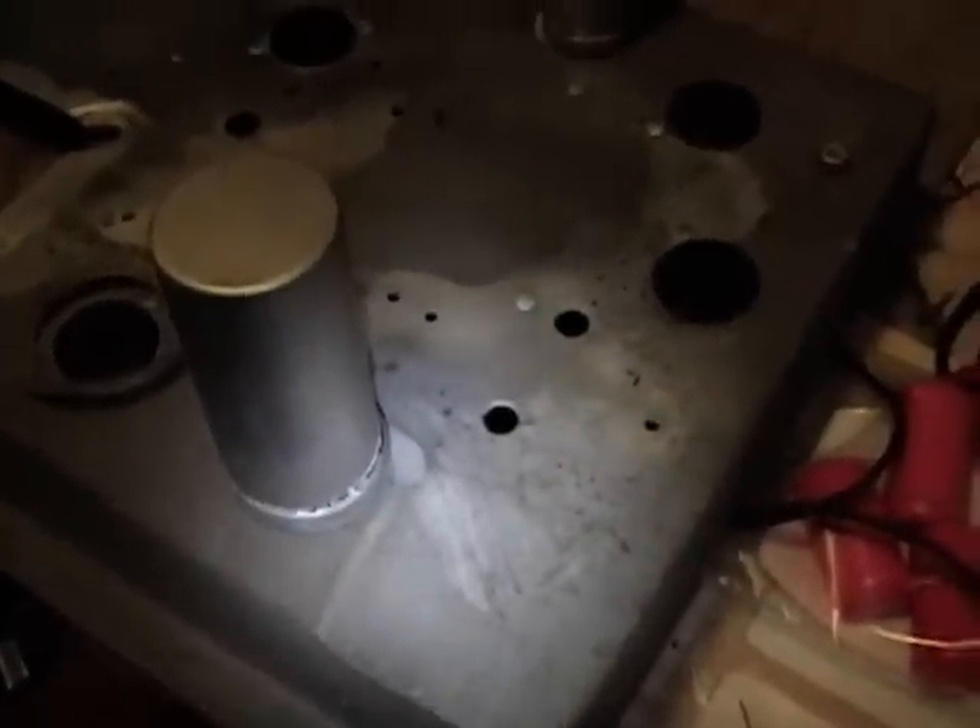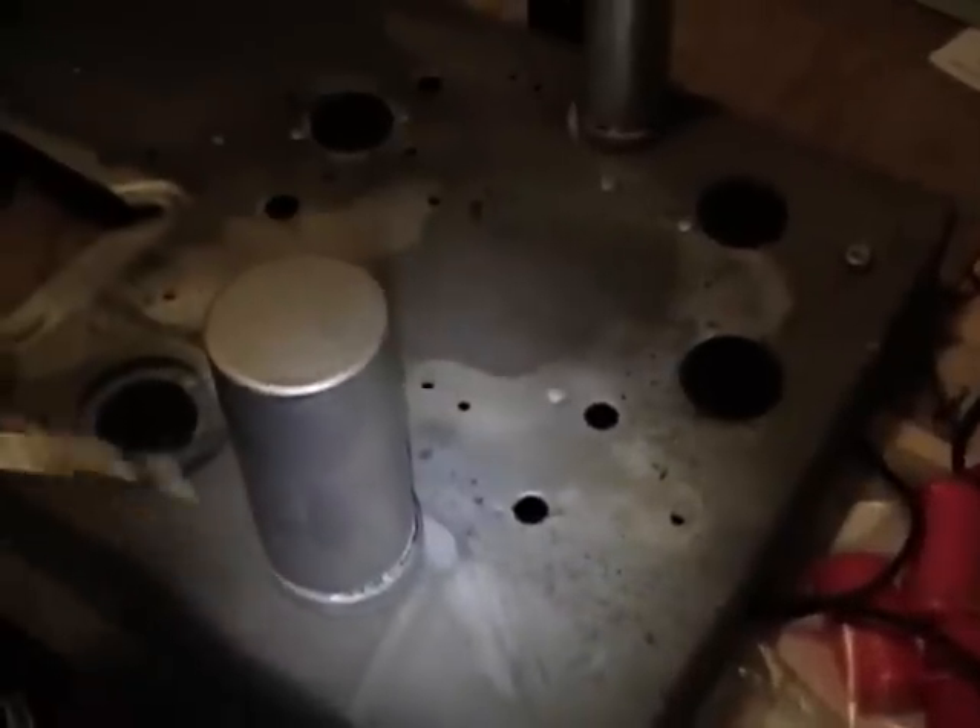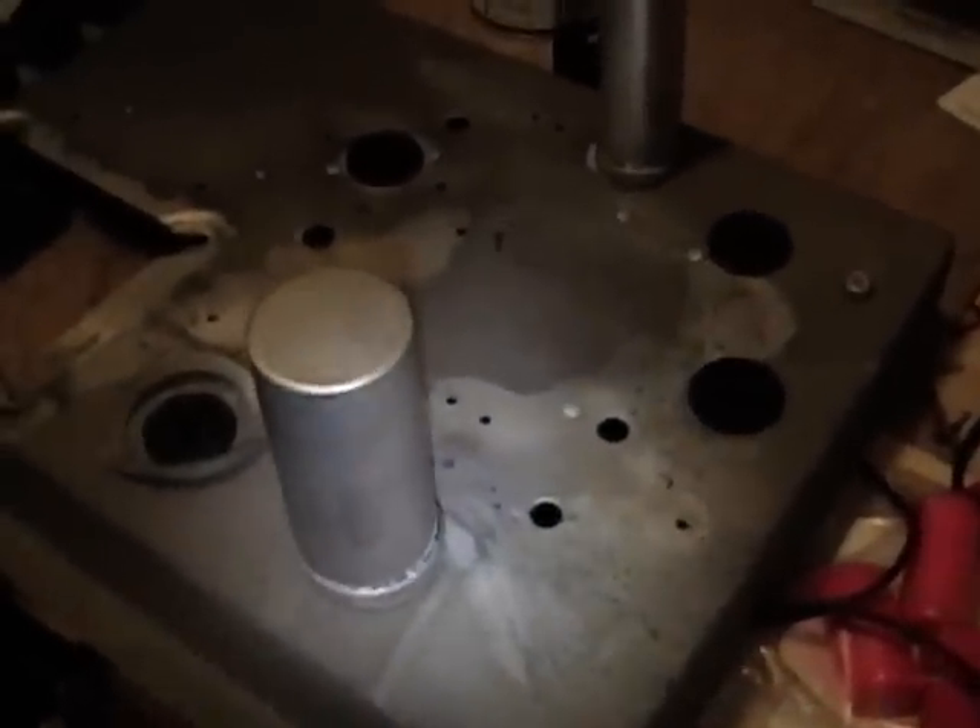That's why you've got to replace these guys. Just make sure when you replace these that you meet or exceed the original specs. Like this was a dual 40 microfarad 450 volt cap, so I have a 47 microfarad 450 volt cap. It's nice to go a little bit higher in the voltage if you can, just to give yourself some extra headroom, but in this case that was the best I could find.